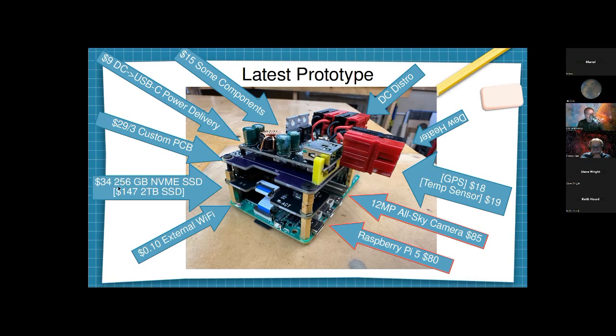The only thing is, if you want to pay $150 for the board. All my Raspberry Pis, I put an external connector on there. All the Raspberry Pis come with internal Wi-Fi. But coincidentally, they have it laid out on their circuit board to accept what's called a U.FL connector, which is for external Wi-Fi. So it's kind of like, don't do this, but here's where you would put it if you wanted to put it on there.